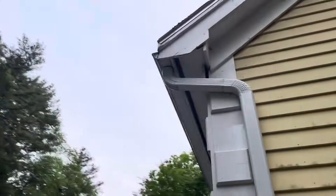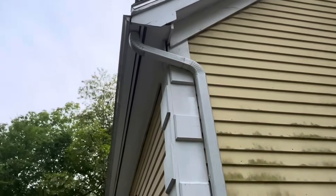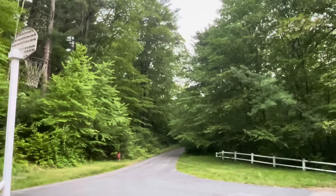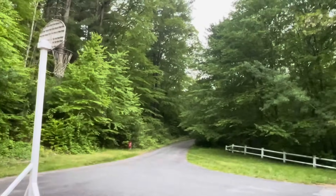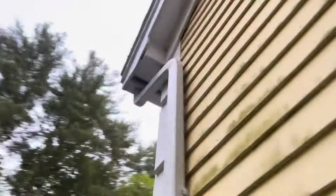Opposite that corner to go outside is the soffit on the outside of the house. What I'm planning to do is run wire over here and add a beacon right about there. The reason I'm choosing there and not right outside of this door is because — if you're not familiar with East Coast standards — many jurisdictions here have a requirement that a red beacon is used to indicate the location of the door closest to the fire alarm enunciator or fire alarm panel. So that would be this door right here. However if you put the beacon here nobody can see it when coming in the driveway, whereas over there it shows which door it is and you can see it from all directions. This will be quite difficult since this is a finished area so I might have to do some drywall discovery.